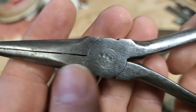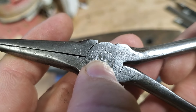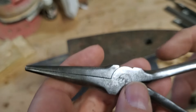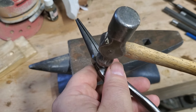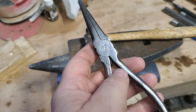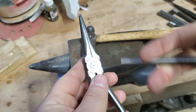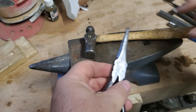The problem is that that's gotten a little loose, and I see that someone has probably used a center punch to try and tighten that up. That's the trick I thought we would do. I went on the internet and the internet had a couple of different ideas. One is to take a ball-peen hammer with the peen on it, hit it with another hammer, and try and spread the entire pin out. If that doesn't work, I'm going to try taking a punch of the right diameter and doing the same thing, trying to peen it out with a punch. I'll try the ball-peen hammer first, because it sounds interesting.